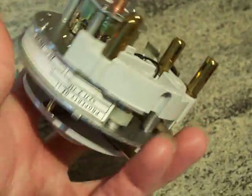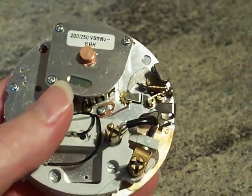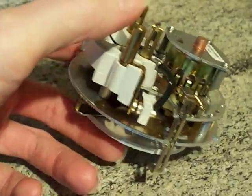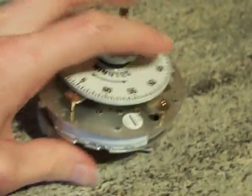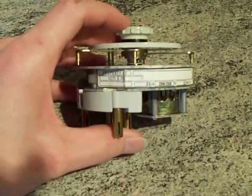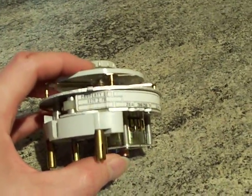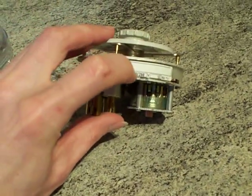I haven't said the model number yet. There are the four pins: one, two, three, four — those two are for the motor and those two are for the contact. It's got 20-amp switching capacity, same as any other Sangamo S250 time switch. Model number: it is S271.2.71E. Characteristics: 20 amp, 200–250 volts, 50 Hz.